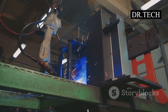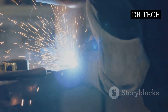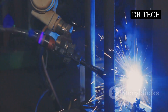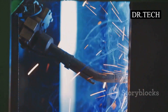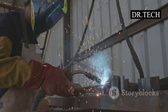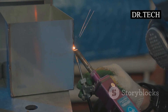Consistent automation means quality — you know each weld will be strong. This has changed how we make everything from cars to washing machines. Finally, spot welding is often cheaper. The machines can be an investment, but because it's fast, uses no filler materials, and can be automated, the cost per weld is very low. This helps keep the price of products down. It's an efficient use of energy and materials — strong, fast, clean, and cost-effective. For joining thin sheets of metal, especially steel, it's often the best choice.